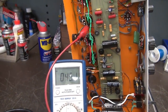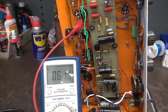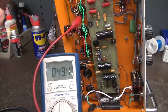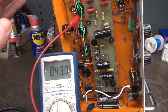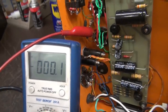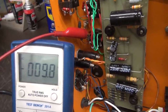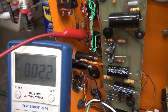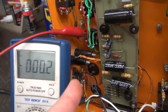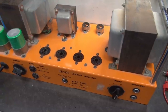I've got the circuit board temporarily mounted. I'm going to bring the amp up on a Variac and just verify all voltages are present. I'll take my Variac and just bump the voltage. I want to make sure the high voltage is getting to pin three of each of the output tubes, then I'll check the screens, and then for sure we'll check the negative bias. Here is my negative bias on one of the output tubes. When you're verifying these voltages, always check at the tube socket. You can check at the power supply and it may be absent at the socket where it really matters.